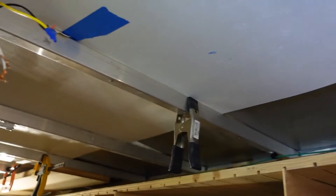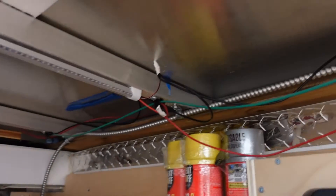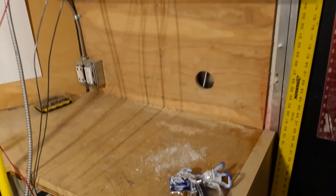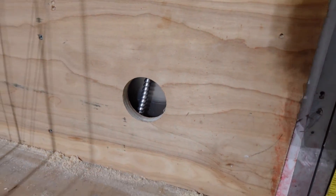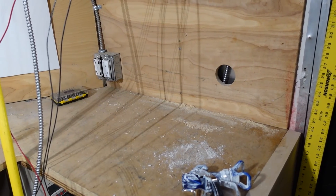For the wiring I basically just cut, splice, and twist them together with tape — and when it gets warmer I'll come back and solder them. You get the two wires in and supply power and we're good to go. The rocker panel is going right here so I can open the door, reach around, and hit the switch to turn the lights on before I get in and trip over everything. That's all we have — like and subscribe, I'll see you in the next video.